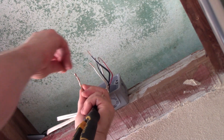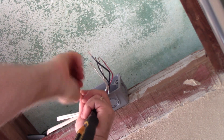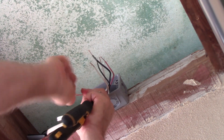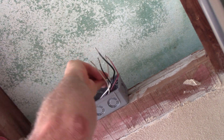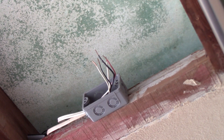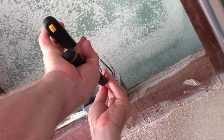What I didn't mention previously: the two ground wires from each cable — just splice them together. This is a plastic junction box screwed to wood, so there's nowhere to ground it and you don't need a pigtail. The photocell doesn't need a ground wire either, so just splice them together and tuck those back into the back of the box.